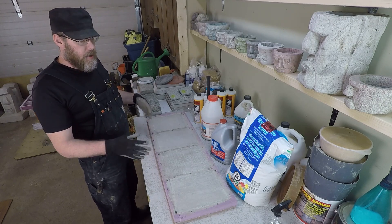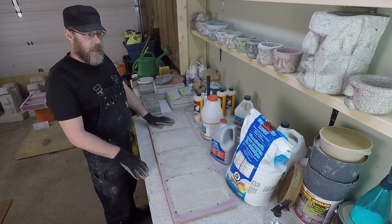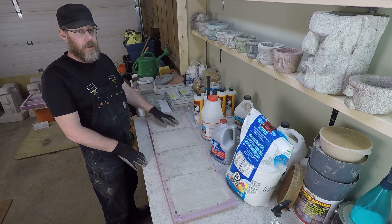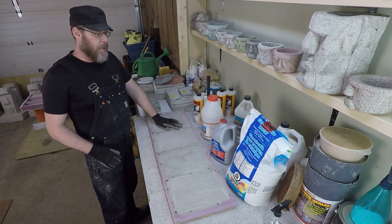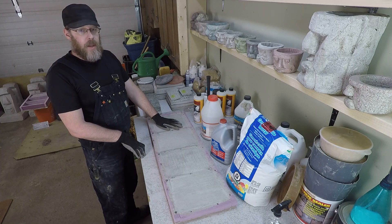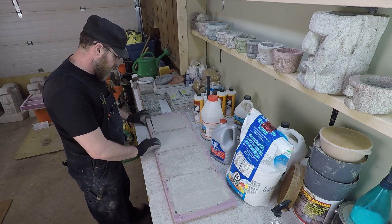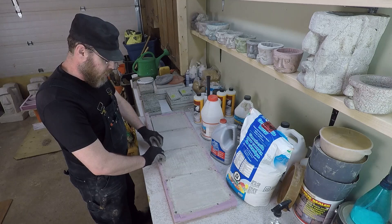That's what we're looking at here: some of the different ways in which you can bond new concrete to old concrete. In my original video on the subject, which was a very simple and straightforward video, the summary was more or less to clean the concrete well, make sure it's damp, apply a slurry, and put your new concrete on top of that. It's a pretty sound process, but it's not a one-process-fits-all kind of thing — there are a ton of different ways to bond new concrete to old concrete.